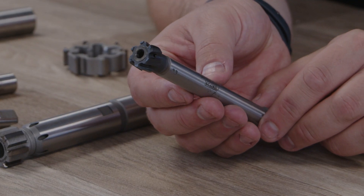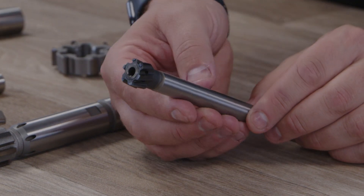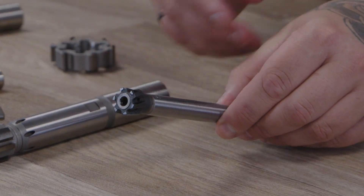And what have you brought with you today? We are speaking about reamers and roller burnishing tools. Our range starts with the monoblock. The monoblock is a single tool, very easy to use because it sets the diameter that you ordered, and starts from diameter 5.8 to diameter 32.